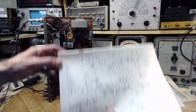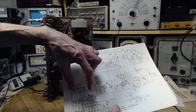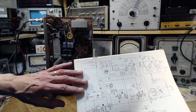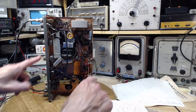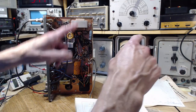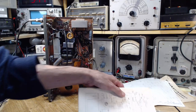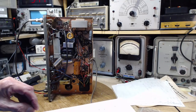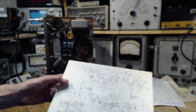That's the whole idea. And so to do that, they have a separate circuit, basically just a tap off the 60 cycle AC. And why are they doing this with 60 cycles anyway? Well, because it's the same 60 cycles that runs my scope, and so you can use the 60 cycles in the 2 devices. That's not exactly 60 cycles, but you get the idea. The 2 devices are locked together by the 60 cycles, so you can synchronize the operation of the 2 devices. And that's why not only this generator, a lot of generators use this trick. This one uses this trick too. The wobbler wobbles at 60 hertz.